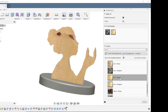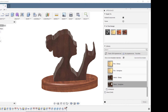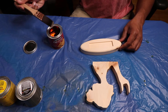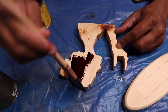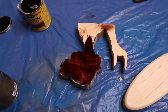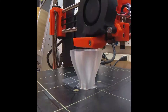I used Fusion's appearance menu to drag and drop different wood finishes and test out color combinations before applying stain. Before staining, I applied a layer of pre-stain conditioner to help the stain absorb more evenly. I decided to go with a red mahogany for the girl silhouette, then mixed red mahogany with ebony to get a darker color for the base.